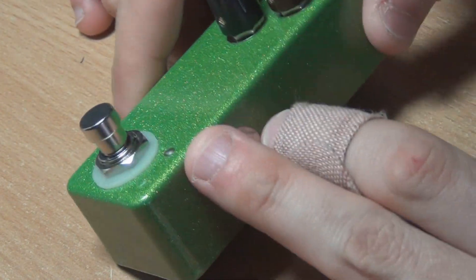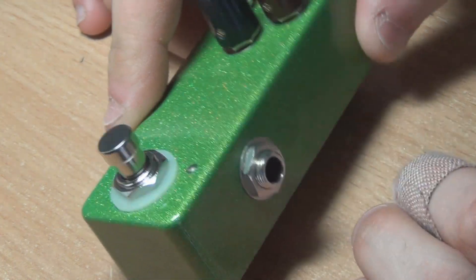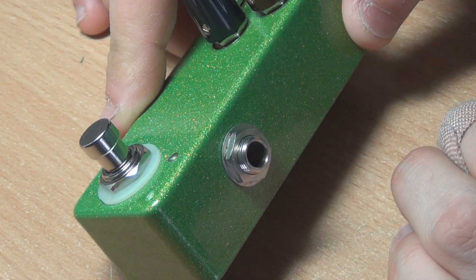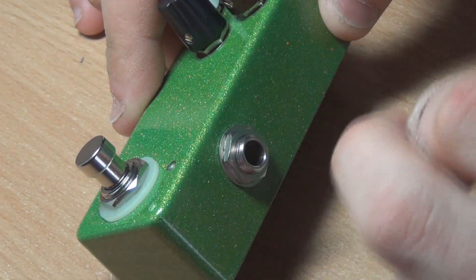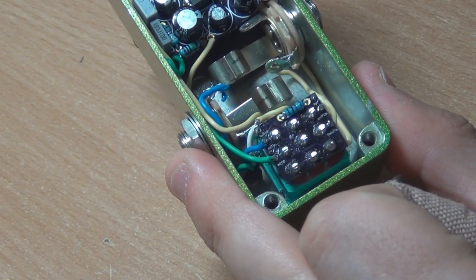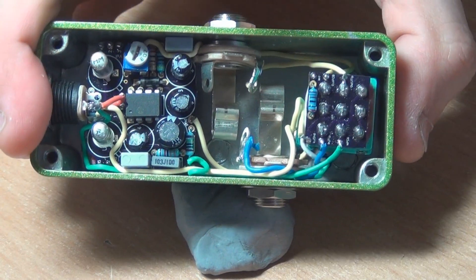Looking on the inside — just one thing though. You can see that I've sanded that LED down, which is a very good idea for 1590A builds — to sand off the top of the lens. There's a video I'm doing specifically on that so I won't ruin the surprise. I'm just going to blue tack this down so you can see it nice and clearly.